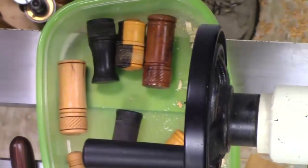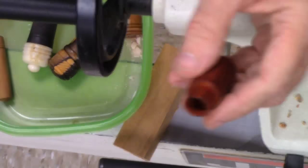So I went from 3/8 inch to a 1/2 inch. So the lid size is 5/8 inch. And that gives you 1/8 inch to divide by 2 to give you a 1/16 inch wall. So that's what we're going to do.